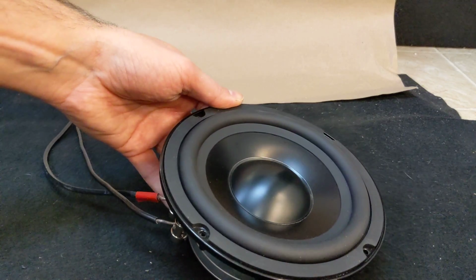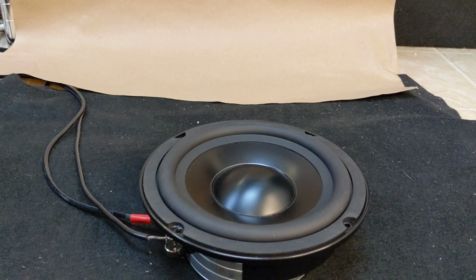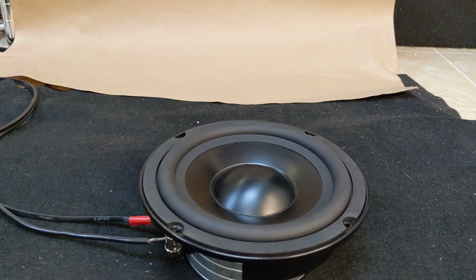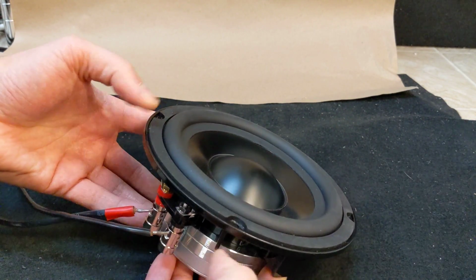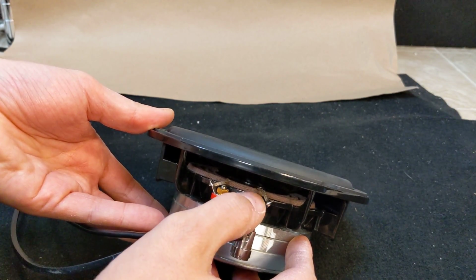And we've got plenty of linear excursion. We're going to send this one out for Klippel again. And so we're looking at that 82% BL is right at 5. We hope to get maybe 6 or 7. I know we were a little bit enthusiastic about pushing 11 millimeter Xmax, but that's really not the case, because we sent the first driver out for Klippel, and basically the cone will hit those, not these metal pieces, but